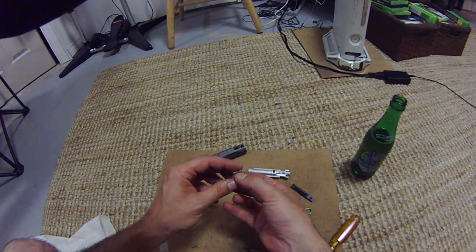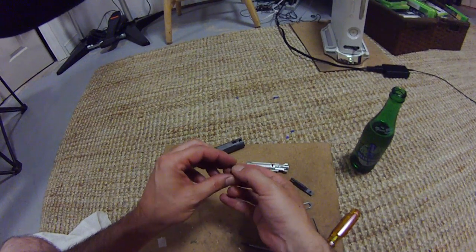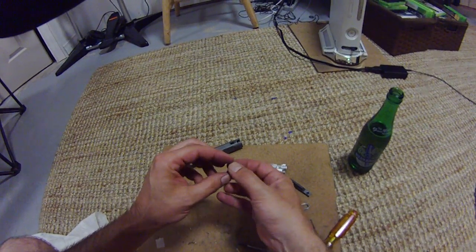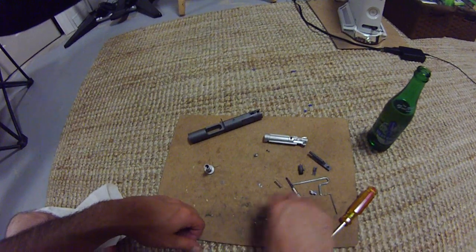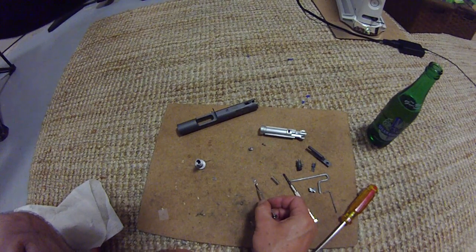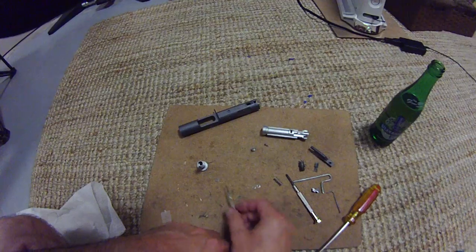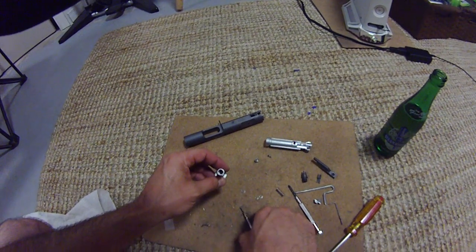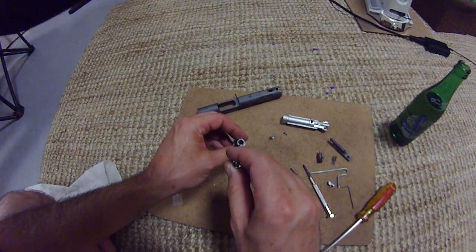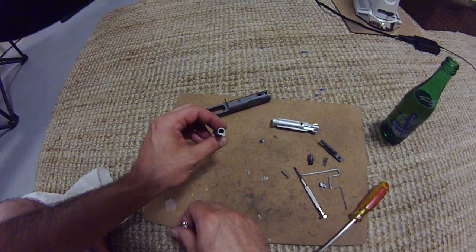The first step is to address the points on the edge of the screw here. Make sure they're sanded off and very smooth so there are no real friction points. The other part is to take a couple of AEG shims and grind them out in the center with a Dremel tool. You don't really need to go any smaller than the inside diameter of the nozzle tube on the inside.